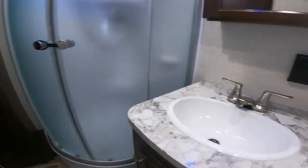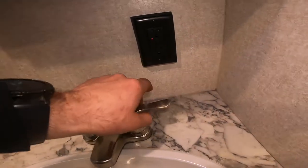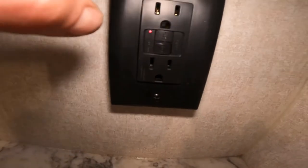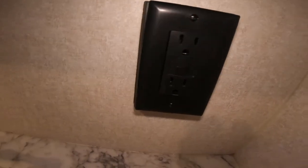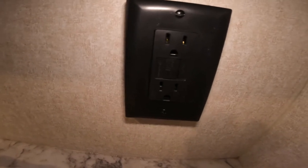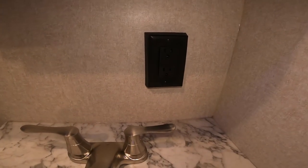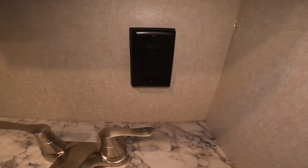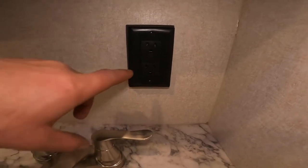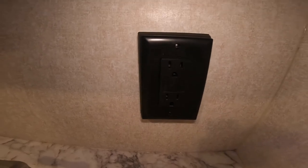Pretty standard shower. Here in the bathroom you'd find your GFCI plug. If you come in here and see that red light on, that means it's been tripped — to reset it, press the button at the top of the plug and it should be reset. If you find that you don't have power on some of your plugs — especially the outside plug, any plugs around water, or any counter plugs out in the rest of the trailer — there's a good chance you may have a GFCI breaker that has been tripped.